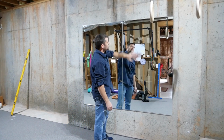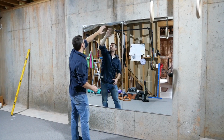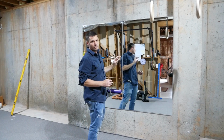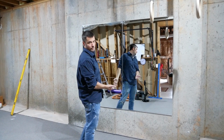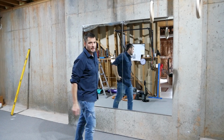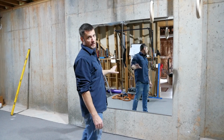Now this mirror here, I didn't really have any room. That was snug as it could be, but this side, the top piece, because of that hole wasn't drilled exactly where I marked, I did have a little bit of leeway, but luckily I didn't have to use that. But let's say I did, I would be able to put in a shim and maybe change that angle by about 1/16 of an inch, maybe 1/8 of an inch, it really depends. But that's something to watch out for.